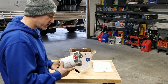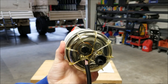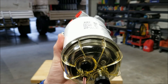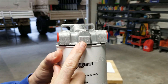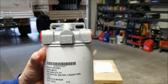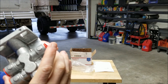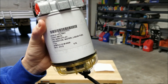The part I'm concerned about — and hoping that it takes — is this bottom section. This bottom section has a fuel heater on it. I don't think I'm going to use the fuel heater because I've heard horror stories about it, or I may use it because this one looks newer. I'm hoping that this bottom section unscrews and fits on the one on the LMTV that I have. I won't be able to use this top section because on the mechanical injection LMTVs — the 3116s — there's a primer on here that you've got to pump to get the mechanical injection pump going. Anyway, I want to get this hooked up. That'll be part of one of the projects today. If not, I've got a spare MRAP water fuel separator for anybody that needs it.